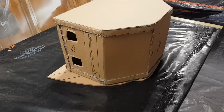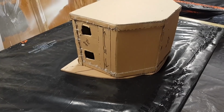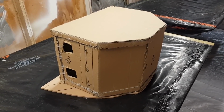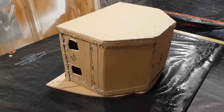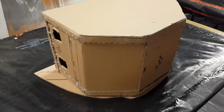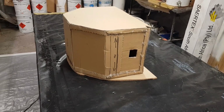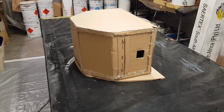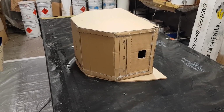I should end up with around about 100 litres per side by doing this, so getting that extra volume by using the hull shape. I won't have to do much supporting to block it in, and I'll probably save around about $1,700 or $1,800 by doing it this way myself. The lid will be a foam core solid lid, and the inside will then be completely gel coated and essentially sealed from microbial action and the like inside the tank.